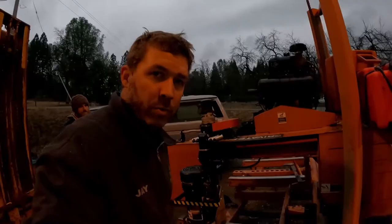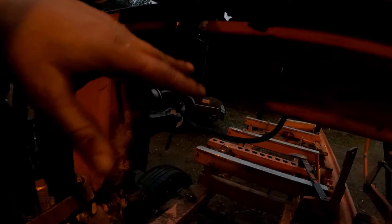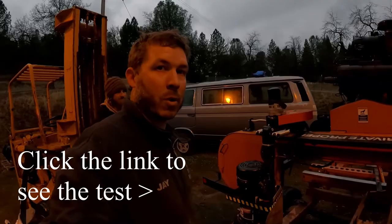It worked pretty good. Our two or three-day project is done. We ended up with a bit of a gap here — you can see where the whole thing comes together. It's about an inch and a half wider than it was stock. If we had just cut another inch off the big bar of aluminum — we used a 33-inch bar and it really could have been 32 — it would have gone right back to stock width. We've got two big bolts holding it together here; the four original bolts from the debarker hold that side on. We've got this piece of aluminum that extends across the gap, and I've got a couple of heavy magnets on here that we'll glue down to keep it covered. He's going to give it some test runs and let me know how it goes. It should extend out to an extra foot and a half at least. Looks like a good setup. Thanks for watching the Dirty Shop.